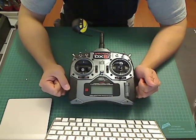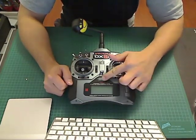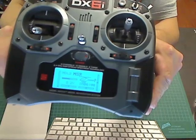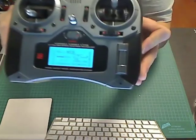So what I did was I ordered some EL panels — electroluminescent panels from eBay — and installed those instead. And actually it's quite easy to do, much easier than the LED mod. So if I turn it on, I'll show you right here. You can see the screen is lit very well now, there's no bright spots, and it looks pretty professional — it looks just like a DX8.